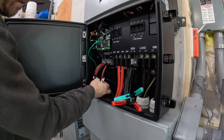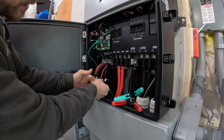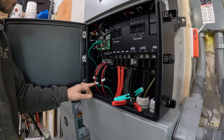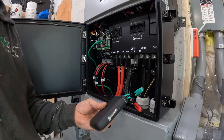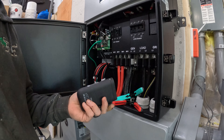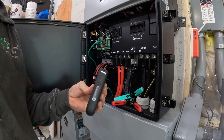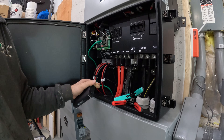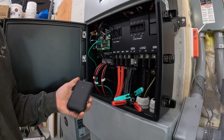Another thing I'd highly recommend is labeling all the wires. At every connection point I put a sticker with the wire identifier — so this is inverter one, and then string D, so I've got strings A, B, C, and D. Every time there was a seam we put a sticker on there. I bought this cheap little labeler on Amazon — it was 20 bucks, super easy to connect to your phone via Bluetooth, very user-friendly. I'd highly recommend getting a labeler to do all your PV strings so you can keep them organized and don't get them crisscrossed. There's a link in the description for this as well.